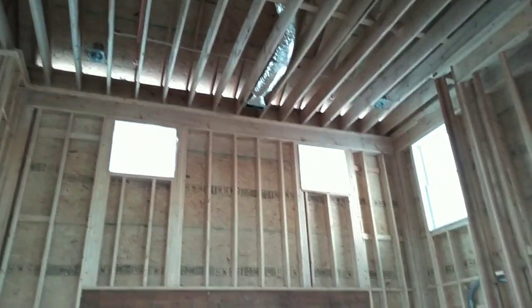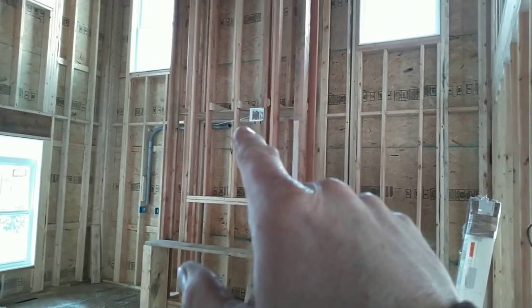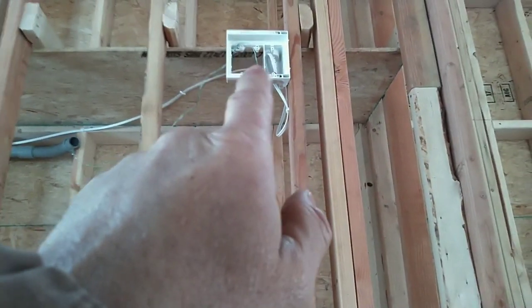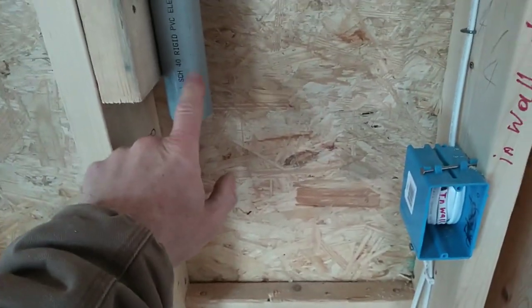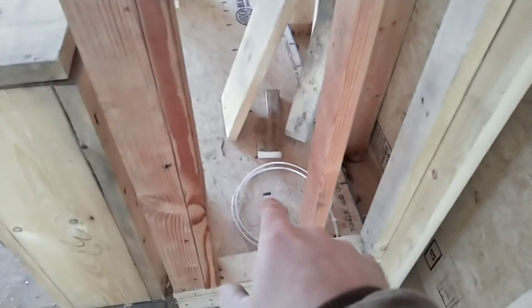Coming into the great room, the large living room. This is a bump-out for the gas fireplace — gas guys haven't come yet. This is an end-of-wall TV box, and I have a one-and-a-half inch conduit pull that goes from there — fish your low voltage on one side, 120 volt on the other side. The entertainment equipment comes out through here, and I cut the back of the box out to make a low voltage ring. You can do future pulls with a rope through the conduit. This powers the entertainment equipment. He's going to have built-in cabinets on both sides to house the TV equipment. The living room circuit wire is coiled up down in here, and this is for the built-in gas fireplace.